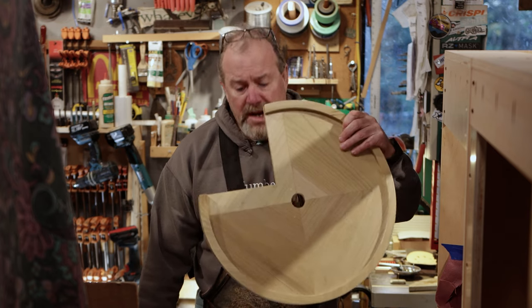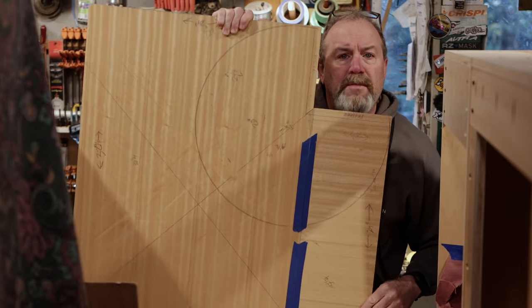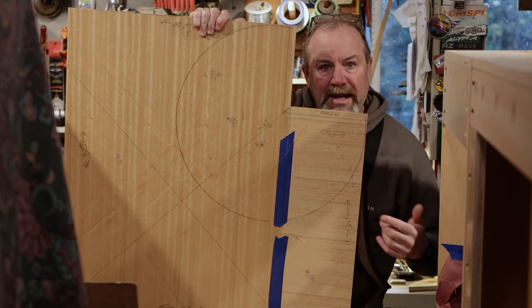Hey everybody, Kevin here. So I realized when I was editing this video, I left out an important part, and that's how to figure out the size of these trays right here. And I do that by just drawing everything out on a hunk of plywood. So always start by drawing out everything life-size if you can to figure out exactly what you need so you don't make something that's wrong.